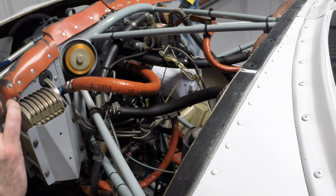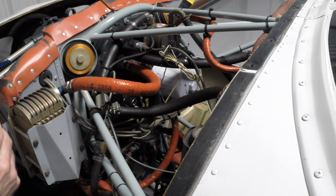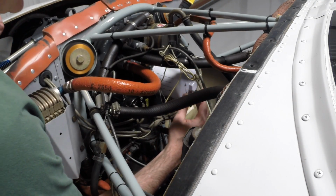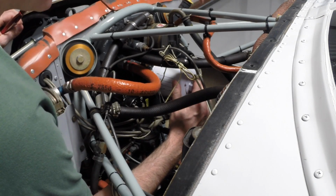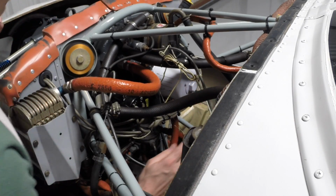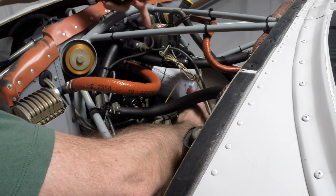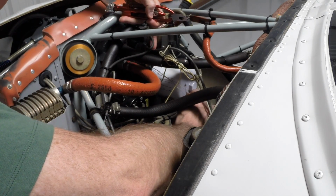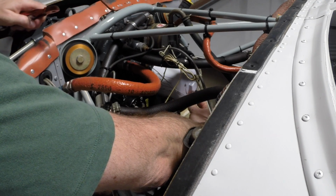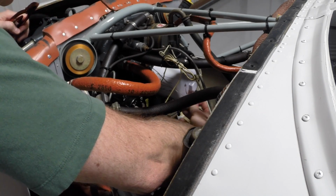So the most tedious part of this whole thing is the safety wire on the oil filter. So we put the oil filter on, and we used our torque wrench and we torqued it down to a measured 17 foot-pounds of torque. And that's right in the range between 16 and 18, which is specified by the Champion people. So I have also threaded my safety wire through the hole that's provided on the engine for the purpose of the safety wire, and I've got it pulled to length to the point on the top of the oil filter here where the safety wire is going to twist in.